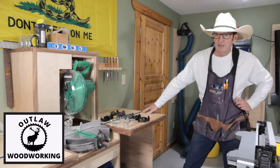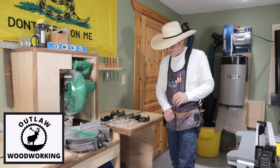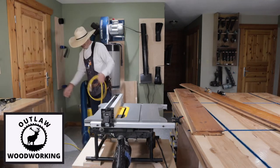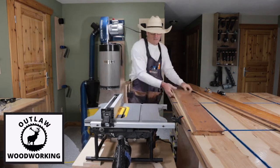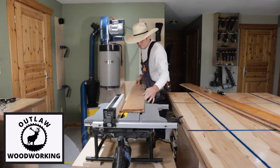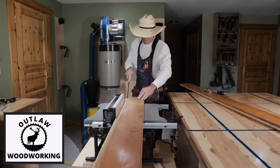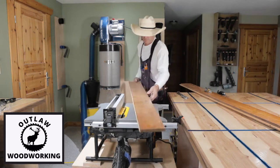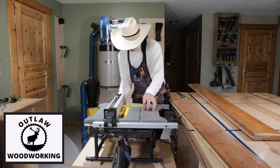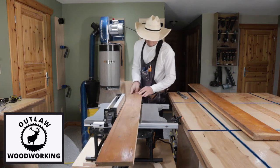The first thing I realized is the boards aren't seven inches wide, so I'm going to need to rip these down and basically laminate some together to make a seven inch wide tower. I decide to clean both sides up and rip them down to five inches so they'll be the right width.